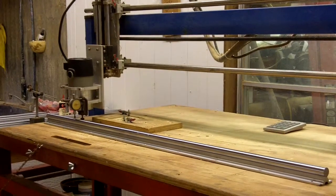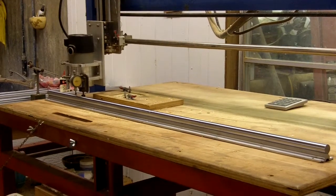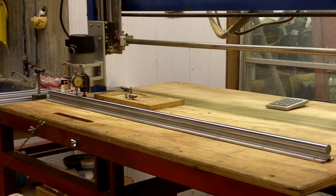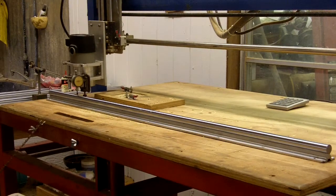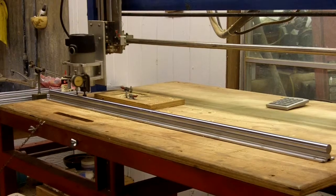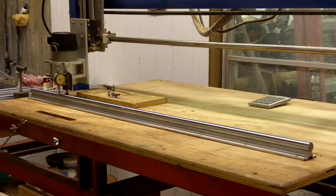Before I do that, I've laid one of the bearings up on top of the table and found there's a little sag in the middle of the table, which I was unaware I had. But I should be able to plane that out or fly cut the table once I get the bearings changed and the supported bearings in place.